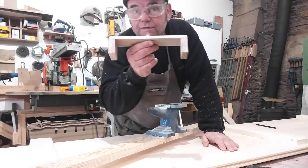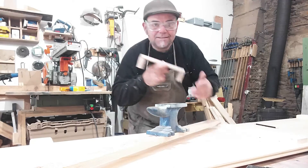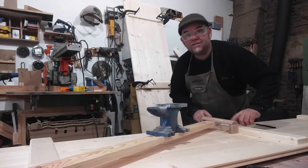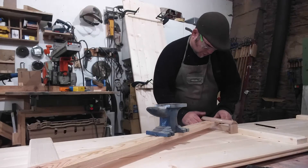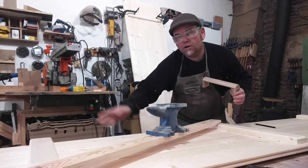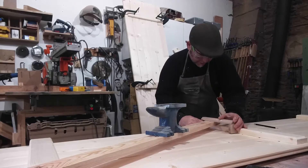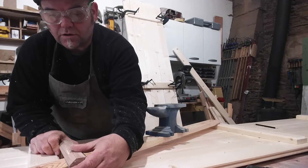I use this little thing I made — it's like a little bridge. All it does is sit over your brace. Once you've got the brace in position, this sits over it and you push it up against the ledge at that point. I also use the thickness of it as my distance from the end of the ledge, so the brace doesn't touch right to the end, which would look untidy.